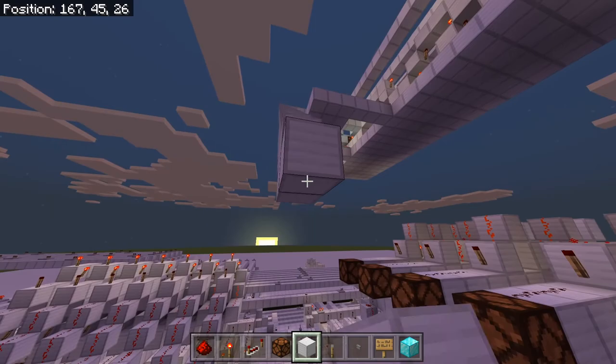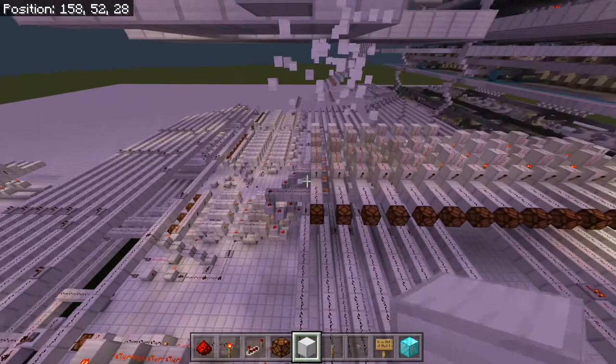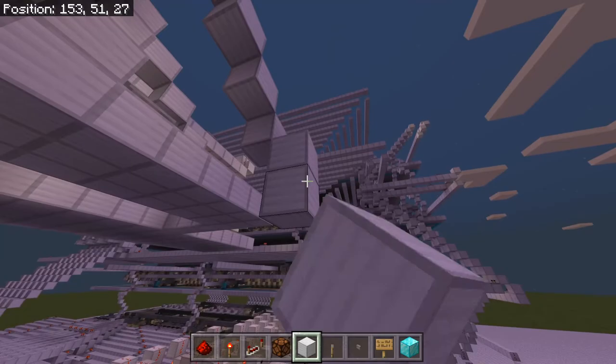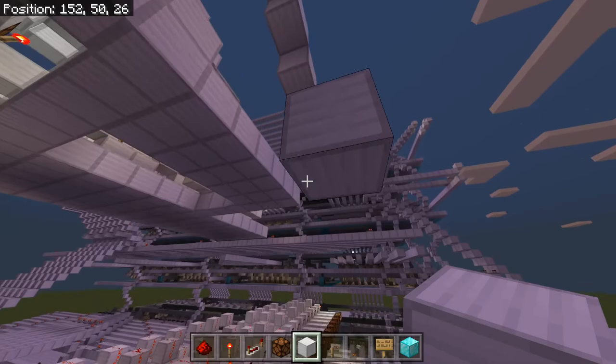Oh, but I don't want to run into my decode signals. If I run into my decoded instructions, then I'm going to end up in problems because I won't have space. So I actually need to be going underneath these. At least I think I need to go underneath and in between multiplexer signals here. The data bus is for the arithmetic unit.